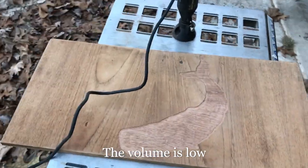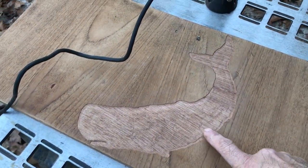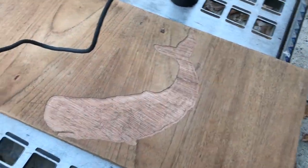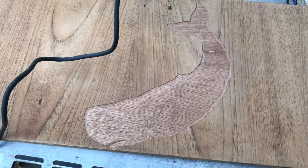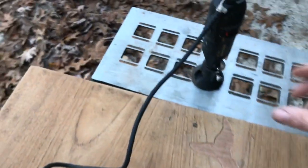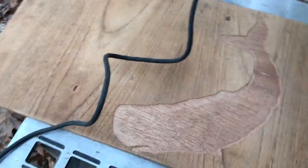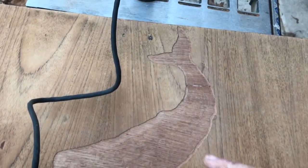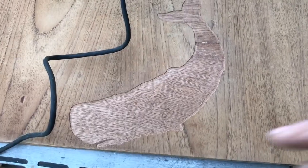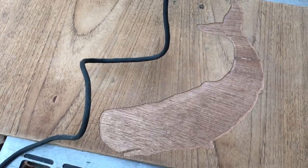So I thought I'd do a step by step this time. As you can see, the inlay is going to be this sperm whale. And this was inspired by a picture that I found online of a medicine cabinet, and I'll leave a link down in the description. But all I did so far is just router out the basic shape, which I traced around the inlay that I cut out of the veneer, and then just went over it with a razor blade and then routered out the center.